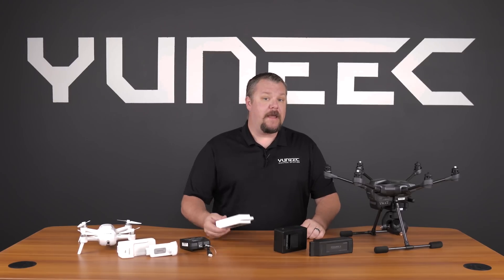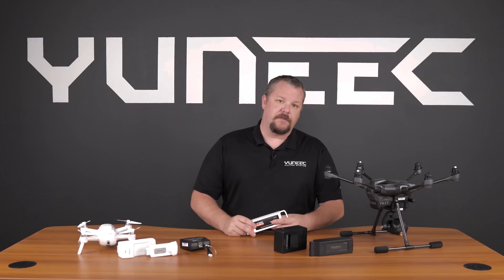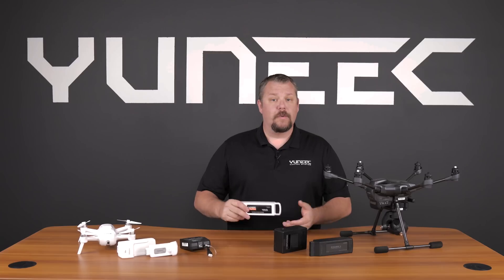Using your battery packs isn't the only time we need to worry about battery management or battery care. Long-term or short-term procedures should be used to maintain your battery and keep it in tip-top shape. When storing your LiPo battery short-term, it's always a good idea not to fully charge your battery packs — always go to about half charge. Leaving the battery on the charger half the amount of time you usually do should suffice.